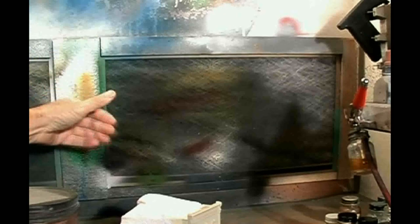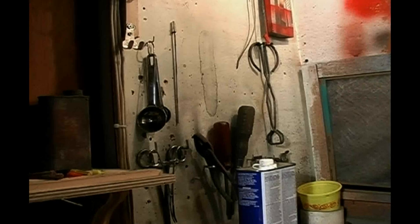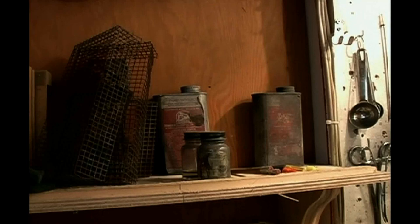Here we see the filtering system — easily removable so I can change them out. There's a baffling system behind that and then a furnace cage blower behind that, which moves a great deal of air. I always have air coming through from the back side of me so the paint stays out in front and I don't have to breathe it. The rest of the booth has convenience items like screwdrivers, pliers, baskets, and cleaning materials all within easy reach. That's the key to making a paint booth work — having everything within easy reach.